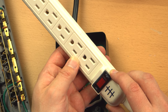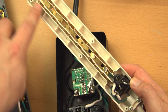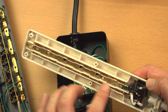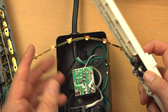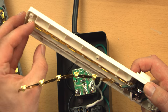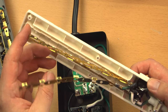which is probably not an LED. Yeah. The point is, that's how it's wired, very, very simply, just straight out to these bus bars. And most cheap power strips have basically the same construction, just a couple of very flimsy bus bars. I mean, look at this. I know it's hard to judge strength just by watching a video, but you could tell this is flimsy metal. These are a little thicker, a little less bendy, but yeah. Not great.